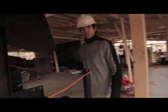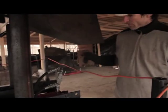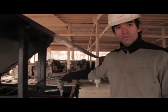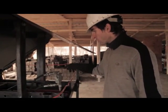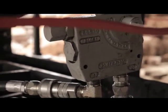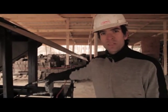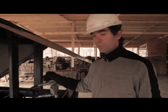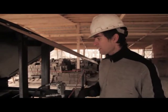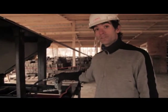Here's another point about the secondary cylinder hydraulic connections. The power in to the secondary cylinder goes through a flow control valve. This both controls the speed of the secondary cylinder and has a separate pressure relief for the drawer cylinder. The purpose is that you don't want to run this at 2,000 to 3,000 psi — you want to run it at about 700 psi, or the minimum amount that still gives enough force to break twigs or pebbles, but not so much that a blockage would end up breaking the machine. So you want to reduce the pressure on the secondary cylinder.